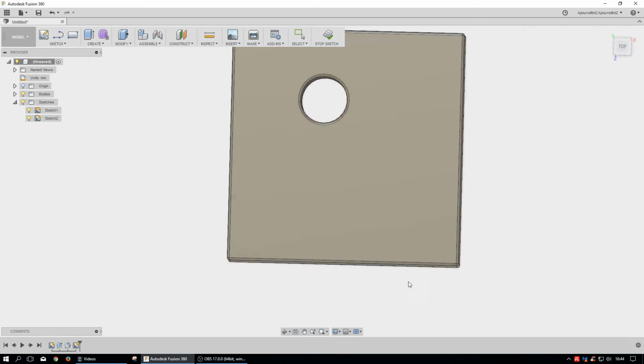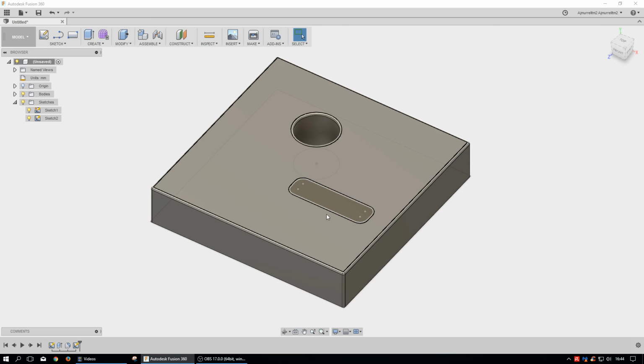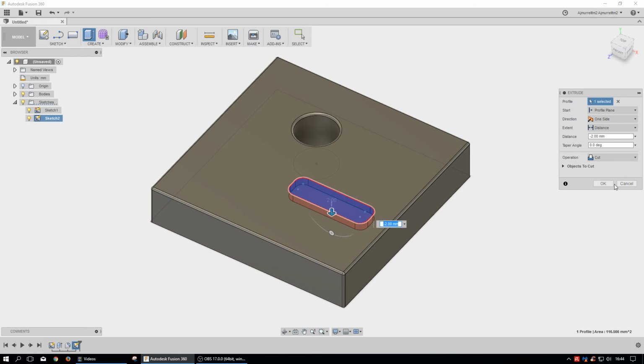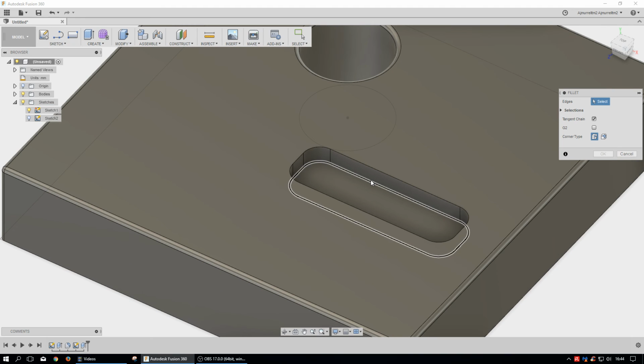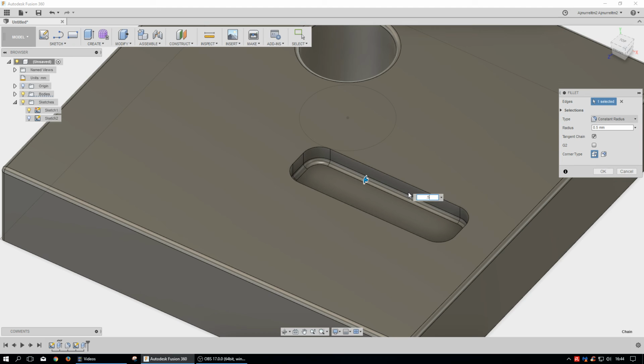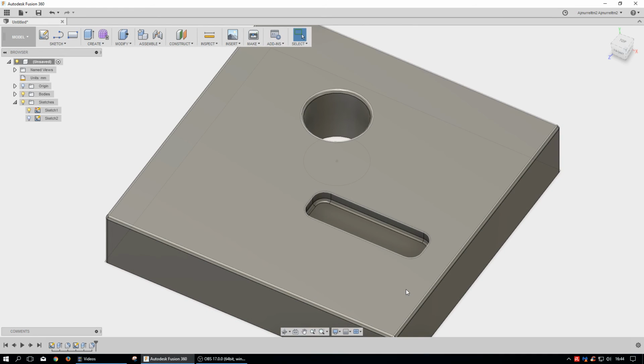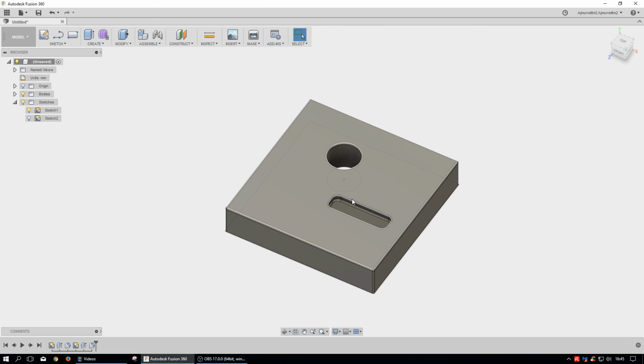And so I can go ahead and, well, let's go back up here. Cut that out, hit a fillet here, maybe chain that selection, go 0.5 on that. That looks pretty good. So you can cut out anything you want, put things together. There's just a different design approach between CAD and some of the polygonal software. So really good for designing parts such as that thumb.